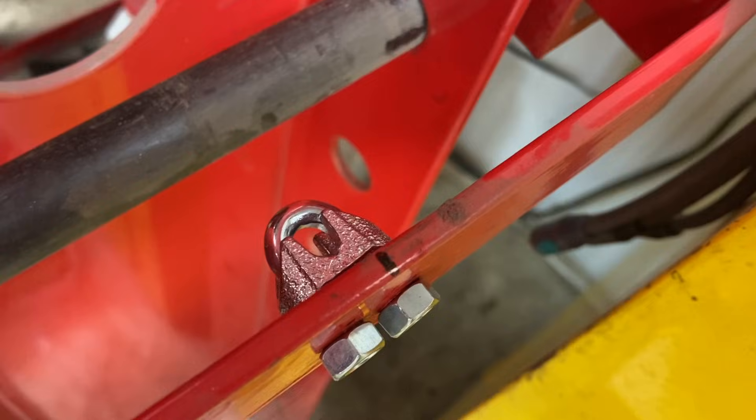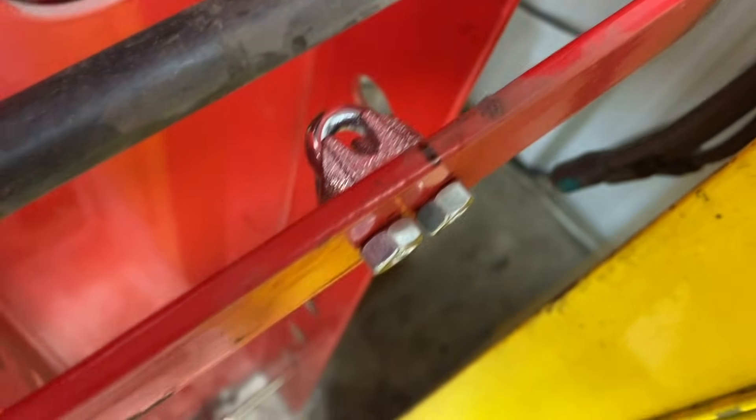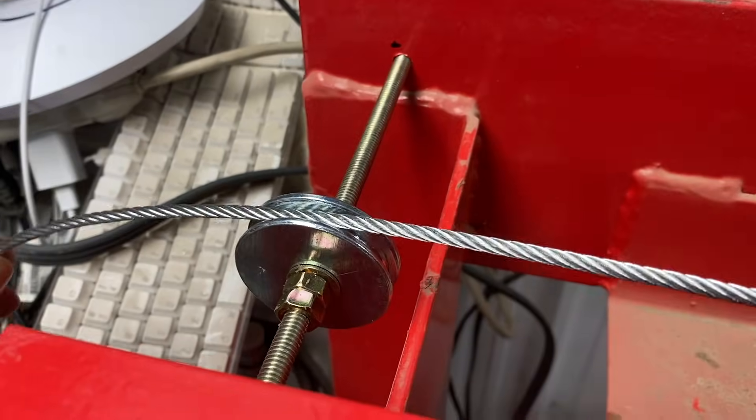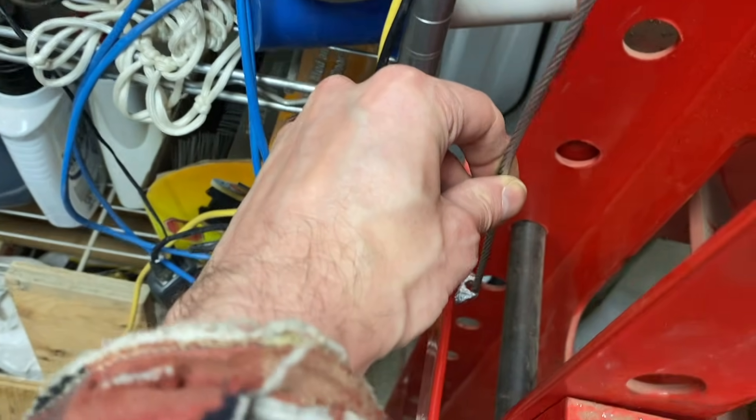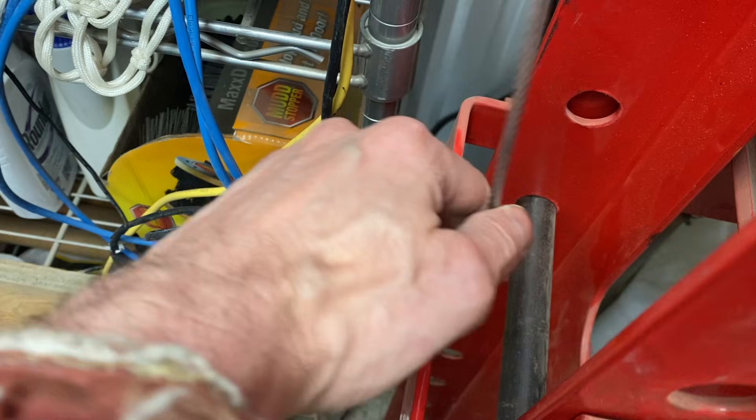Here's our winch mounted. You can see I put the bolt down there, the other bolts here, and I just drilled and tapped these. Down here I put a cable clamp that'll lift it, and way down there on the bottom. So here we'll run it down and have it come through this cable clamp right there - bottom pulley and our hole underneath.